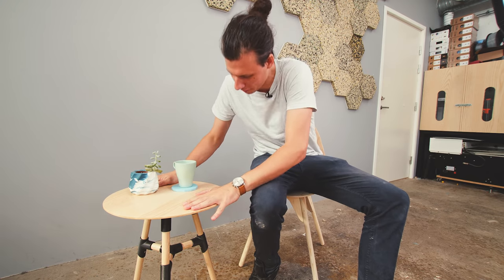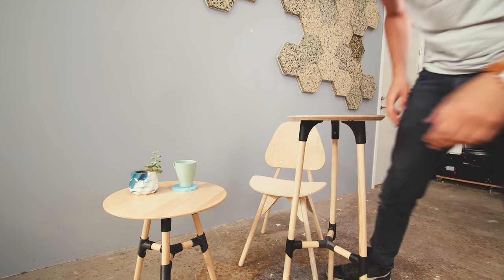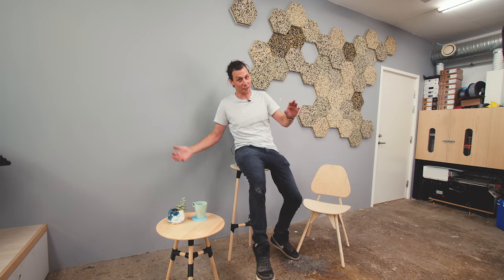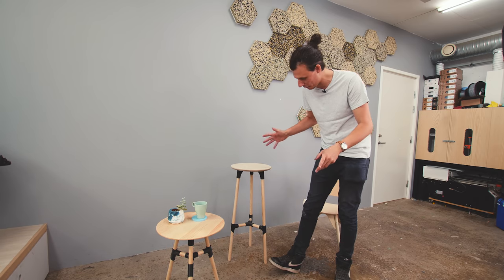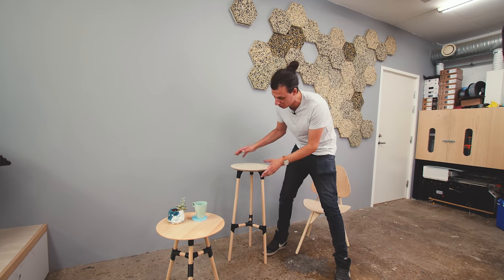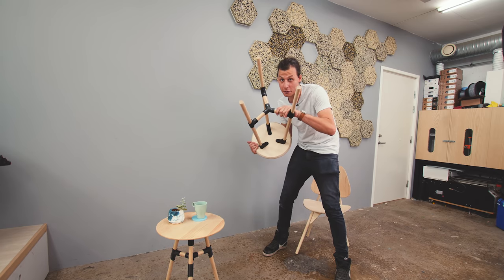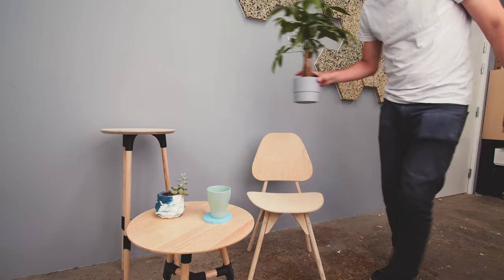I'm super happy with this, and the whole thing feels really sturdy. It's almost like you could sit on it — and actually I think you probably could. So yeah, I made a little bar stool as well, made in exactly the same way as the side table. The only difference is the angles of the printed parts and the lengths of the wooden parts. It definitely works, but it's a little bit too flimsy for my liking. That could probably be fixed by beefing up the plastic parts, making them longer, or even making it a four-legged stool using the same parts for the legs — the only difference would be the middle part needing four holes instead of three. So maybe for now it's best used as a decorative item rather than something to actually sit on.